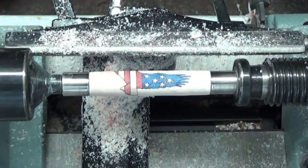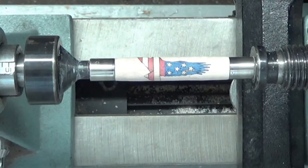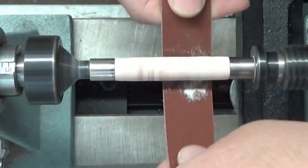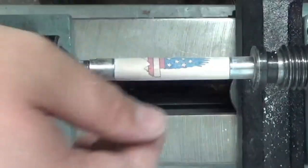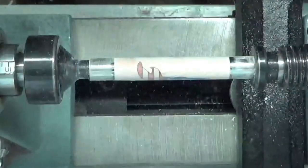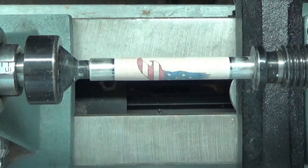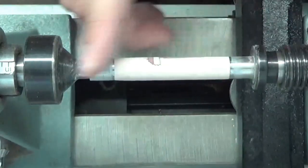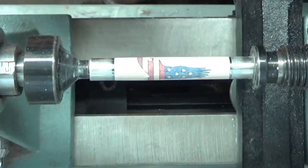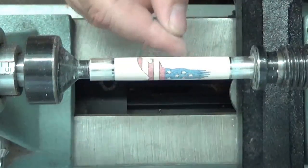I got that about as close as I want with a blade. Now we're going to hit this with 150 grit sandpaper to get it to our final size. Turn the lathe down to 1800 for sanding. Move on to 220. You go back and forth while it's spinning to get the rotational scratches out, then you go back and forth by hand with the grain to get rid of those rotational scratch marks. Then you can move on to the next grit.